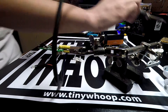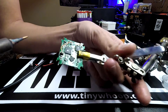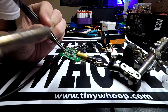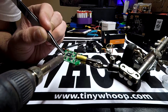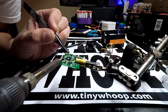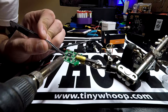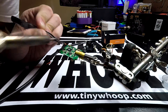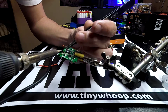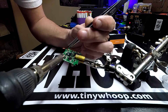We'll clean up these solder pads just a little bit. The next thing we need to do is remove this capacitor right here. We're going to heat up both sides — and actually when this blows up it's pretty crumbly, so it's pretty easy to get off. We'll add a little bit of heat over here — see how it falls apart — and then add a little bit of heat over here. Let me take a step back from the camera so we can actually get this off. I'm going to let it sit for a second and cool down.